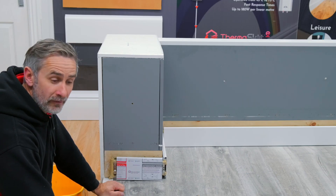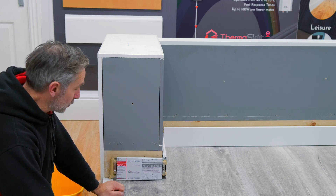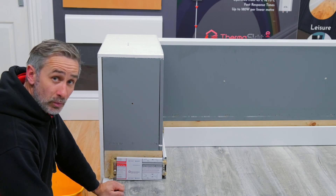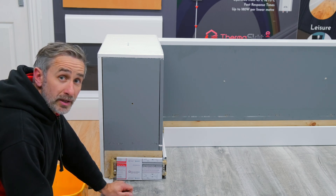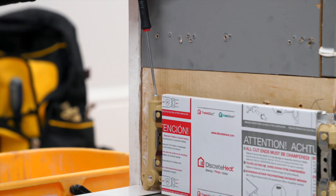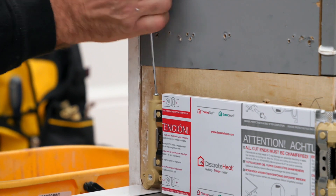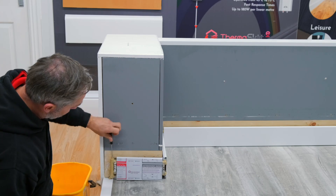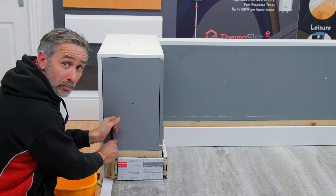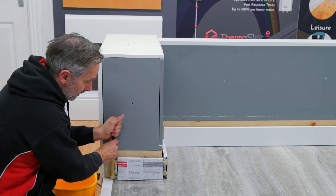As you can clearly see, the skirt is just not quite finished yet — we haven't added the covers or the gasket — because there's one more step before we do that: the commissioning process. Just like a radiator, the skirt also has a bleed vent at the top. As you introduce water into the system, use a flat or cross-head screwdriver to unscrew the bleed screw. You should start to hear air coming out, and then, as you can see, water will start to come out of the top of the vent. Once you've got water through there, you can lock that off and fire the heating up.